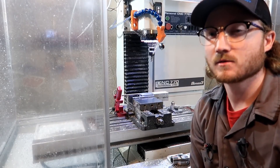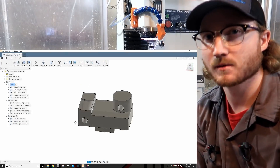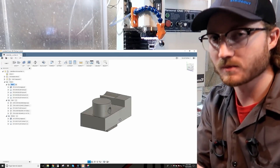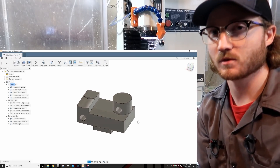So I bet you're wondering what I'm getting into. Basically, I want to try and machine one part with one setup. I'm going to zero everything out one time only but then flip the part around. So it's basically like a fourth axis but with no motor.